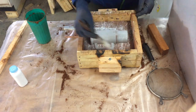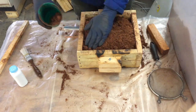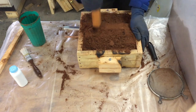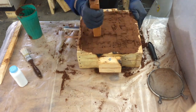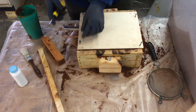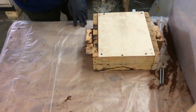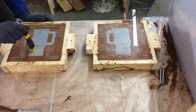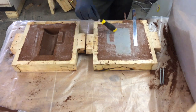I add the top half of the mold and repeat the same process. Tapping on the pattern half before you pull the pattern out of the mold vibrates the pattern and helps it release from the mold.